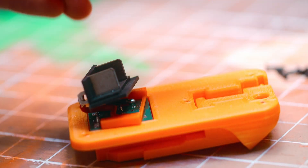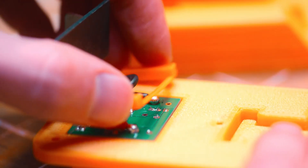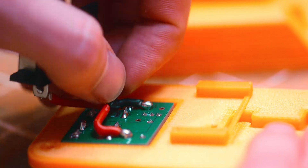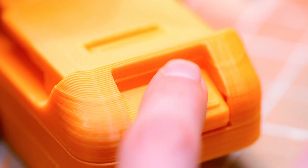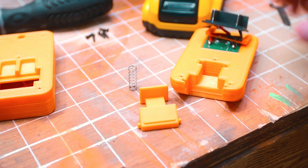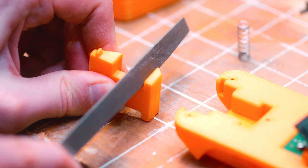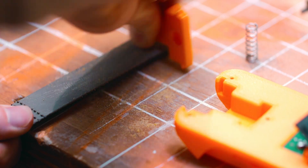As I expected, there is a little circuit board inside with a couple of resistors on it. So I would have to make some electrical modifications to turn the Bauer into a DeWalt battery. Since I'm going to be using this adapter, I want to fix this locking switch. Because the part was 3D printed, it's got layer lines which make it stick all the time. The solution is pretty simple but tedious — I just have to sand down all those layer lines so it's smooth.